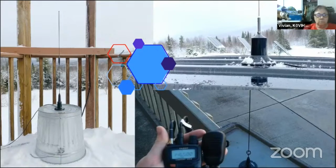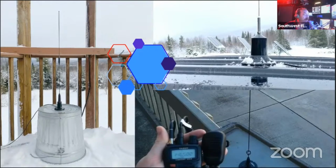That is an interesting point. And you know something, Vivian? I go to bed at night at 11 or 12 o'clock sometimes. I'm working weird hours. Let's say I go to bed at 11 o'clock. I'm SWR'd out on 40 meters on FT8, and I shut it down and go to bed. When I get up in the morning at 6 or 7, there's dew on the grass, in the trees, on the roof of my house, on everything. When I come out here, my SWR is different. I literally have to get on the knobs and retune to get my low SWR, because I'm a bit picky about it. I'll be at 1 to 2.3 or something, and I can get it back down to 1 to 1.4, but I have to work it back down again.